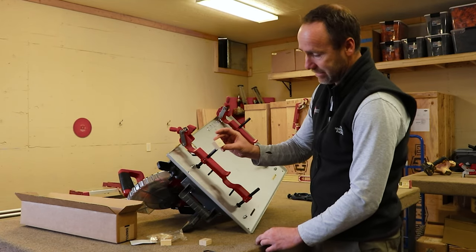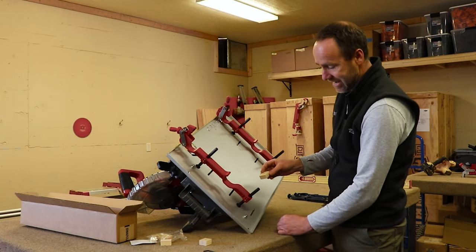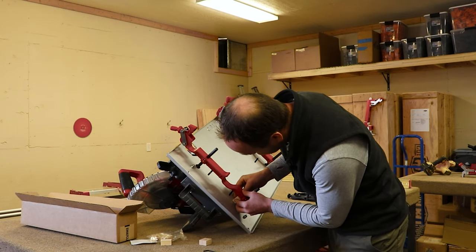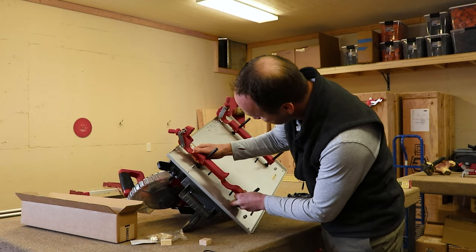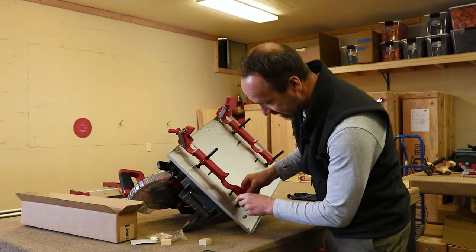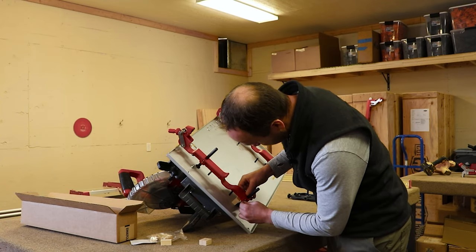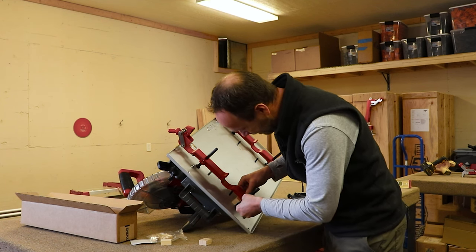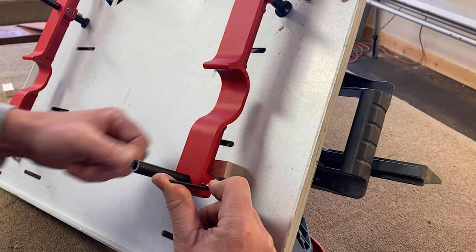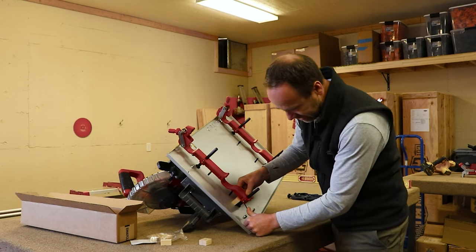It's important that as you look at it, the back is the back of the saw. I'm going to stick this shim right here basically against it and push it down until it engages. Once it's engaging, I'm going to tighten up only one of them. I'm going to tighten it down — it doesn't matter which one — but tighten it until it engages with the black stud. Okay, I've got it pretty tight. Now I need to do the front.